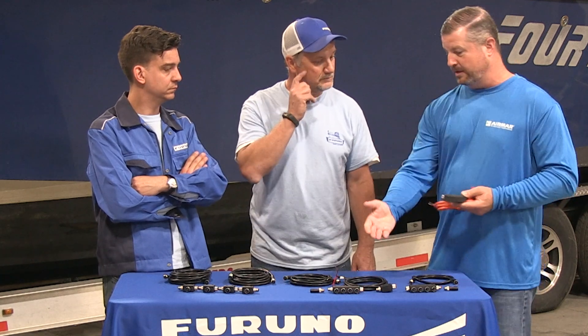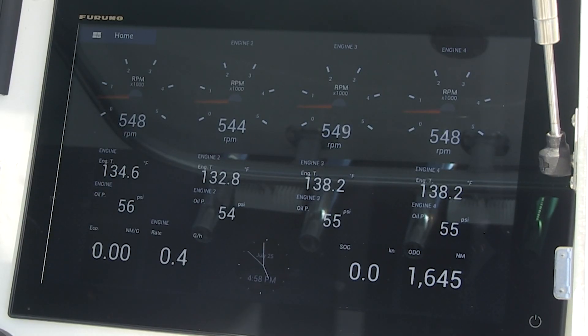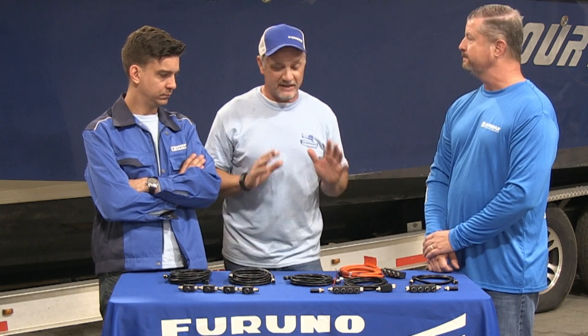If you're in the field, you could actually break a network in half, connect it here, and troubleshoot separately. There is an existing NMEA 0183 interface to the Mercury Verado network, but we're going to add a Mercury NMEA 2000 gateway so we can get a lot more engine data out of the system and push data back into the Mercury. It's a safe gateway designed as a bridge between the two devices, and it has a firewall built in so that if something goes wrong on the NMEA 2000 network side, it's not going to affect the engines. We're going with a complete NMEA 2000 system — there won't be any 0183 on this boat anymore.